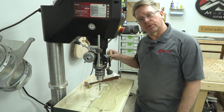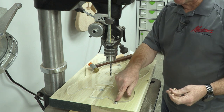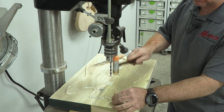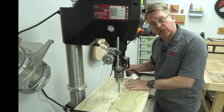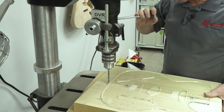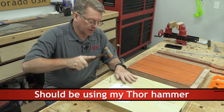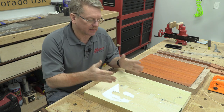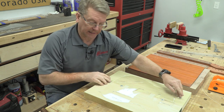Just for caution's sake, I wouldn't drill the second hole right away, because if the template shifts a little bit those holes won't be perfectly aligned. What I'm going to do is establish an anchor point with the one I've already drilled — so even if the template moves, it'll be anchored at that point. Just flush-cut off that extra material, and that is now an anchor point. Then we can double-check that our second point hasn't shifted and drill that out. Now that both points are drilled, the alignment is set in stone and will remain this way no matter what template we use, since they all use these off-body alignment points.